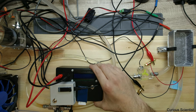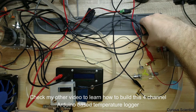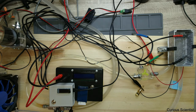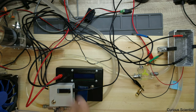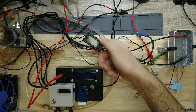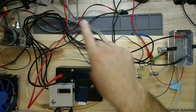This is our already known temperature logger. I will use these four DS18B20-based thermometers — two of them will be in this container, and two of them will be distributed somewhere else. The water tank is somewhere there and one will be immersed in it, which is indirectly measuring the hot side temperature. The hot water comes out here, goes through this flow indicator, one temperature is measured here by this metallic piece, and then the water does a half circle and goes back to the tank.